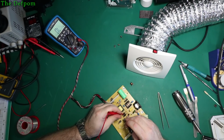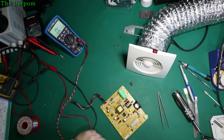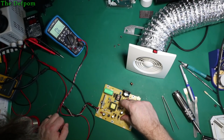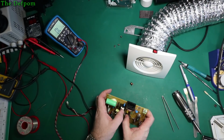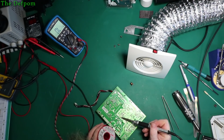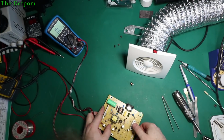That one's shorted. Yep, that one there's shorted out. Cool, actually found something. So, looks like that diode there is blown. So let's get the thing out. The other one looked okay. There's a Schottky. It's very low resistance, so it's only like 0.15 ohms or something, so 0.15 volt drop, sorry. I don't know if I've got anything which I can use to put in there, actually.